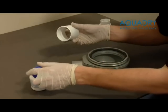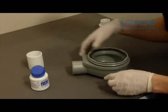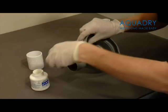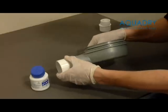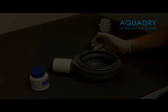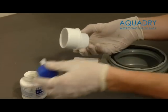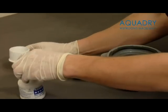You are now ready to install your waste pipe and trap, which is found in the installation kit. The waste trap and fittings are all solvent weld products. We recommend that you keep all pipes and drainage parts clean at all times, and that they are cleaned properly with the appropriate solvent waste pipe cleaner prior to connection of all the fittings. After cleaning, apply the solvent weld adhesive as shown. The pipe moulded to the trap is a 2 inch standard solvent pipe and has a built-in 3 degree fall. Firstly, you need to fit the 2 inch solvent connector to the trap in order to then connect to the rest of your waste pipe.